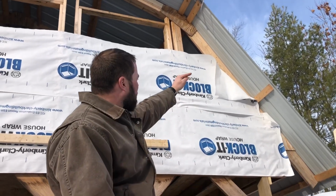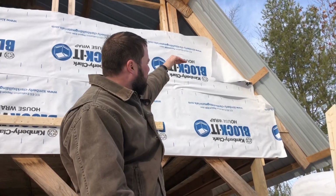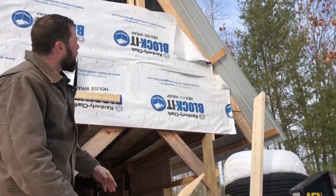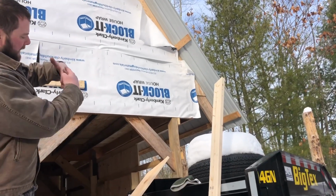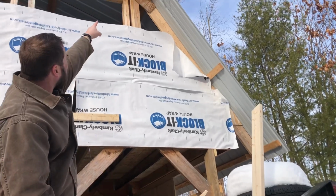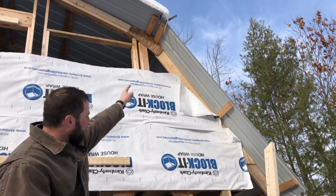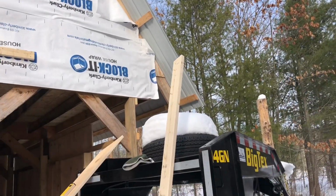And my plan was to cut the metal, half of it off, take it off, and then from there drop down to the shed roof. But then I would have like an inside angle and the snow load would sit there. So what I think I'm gonna do is extend this, take off all that metal roofing and extend it from there down to the shed roof.